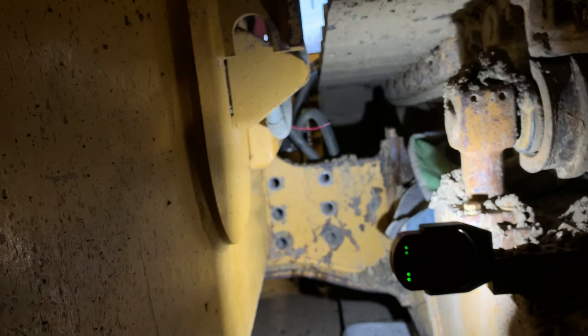We'll get to the other side and they'll be ready to back up. Go from there. I'll take some pictures and film over there of what we're dealing with when we get it out. Those pins on both sides wouldn't take grease, so we'll take the C-frame off. I think they tried to heat it today — they've done everything they could. They said one of them was trying to take grease, the other wasn't. These auto-lube systems are good, but when they're shut down and you don't have all that grease, it can get tough sometimes.